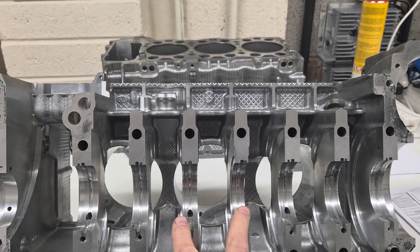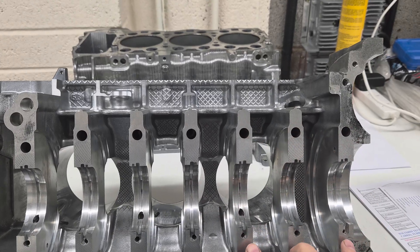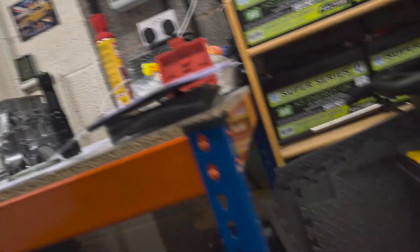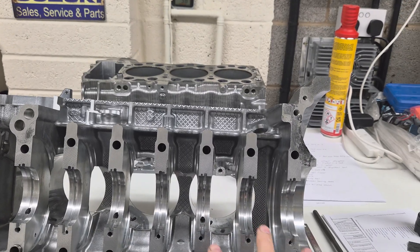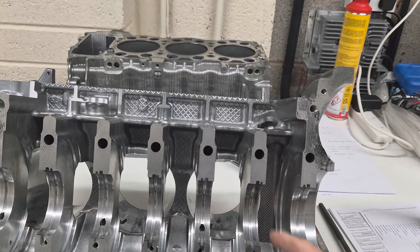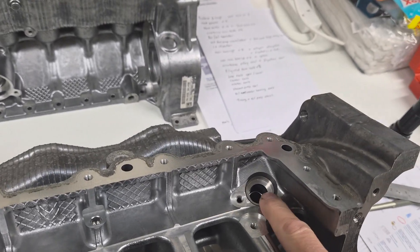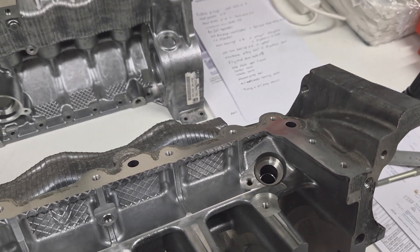None of the other cylinders have them — they only have two. So we've got three sets of two crankcase securing bolts, which are quite chunky things. Imagine the torque going through here to clamp those crankcases together, all occurring around this area. And Porsche have used this area for the main artery from the oil pump.